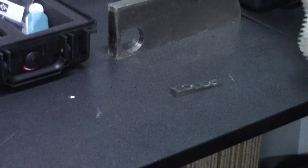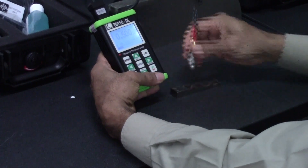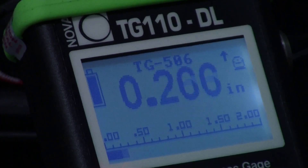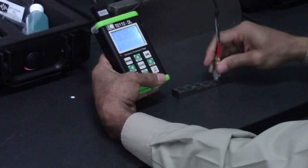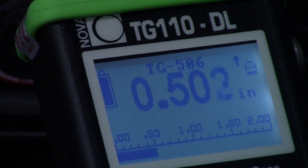It can give you numeric readings. If you had your step block — say a half inch block with various readings stepping down to 0.4, 0.3, 0.2, 0.1 — this will give you very accurate readings with high resolution.